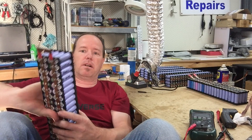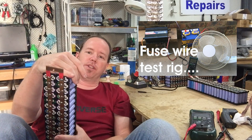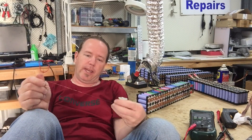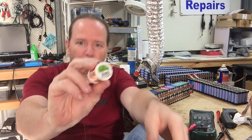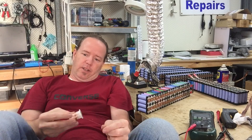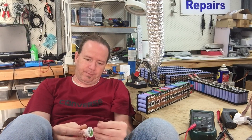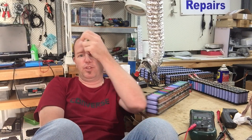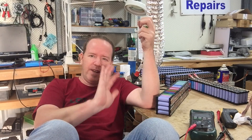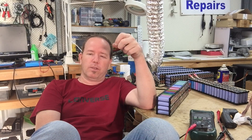Basically what I've got — I'll link up here a video I did on how I tested the fuses and how I worked out that this fuse was good for my project. I'll link that below. Now I did this test and I did what I thought was right, testing this fuse and making sure. And up until now I've been telling everybody that this fuse wire, in my test, blew at around 4 amps — it did vary between 4 and 5 amps, but I'd say 4 amps was a fair call for the wire.